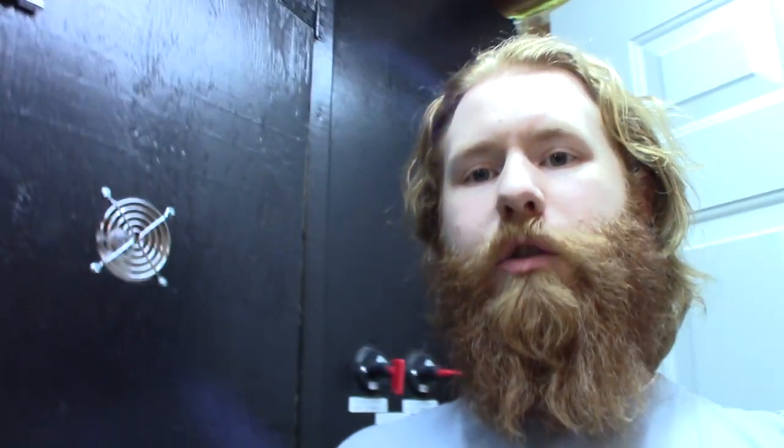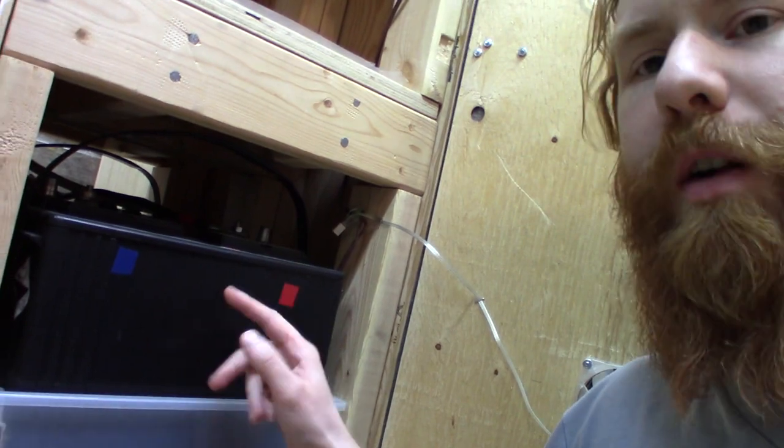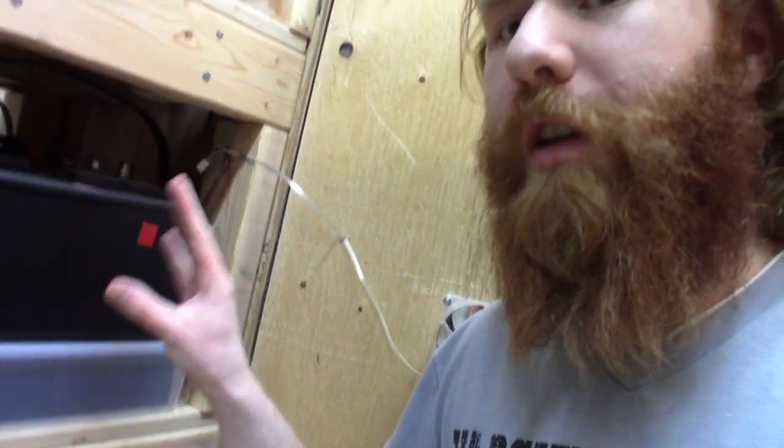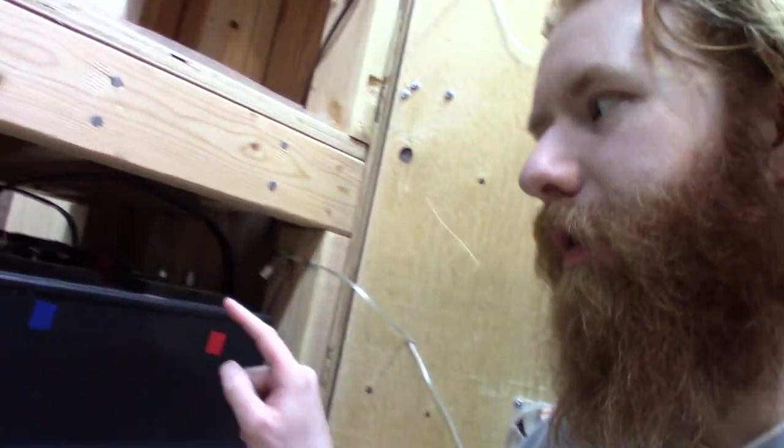In this video I will be doing the battery maintenance, so without further ado let's go do that now. Here we are in the server room. The two batteries we're maintaining today are these ones here — one on each side, they're in parallel. Actually all the batteries in here are in parallel but split into two different groups, so we'll be taking these out and checking the water levels and then adding water.